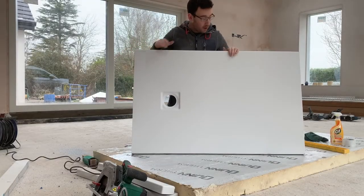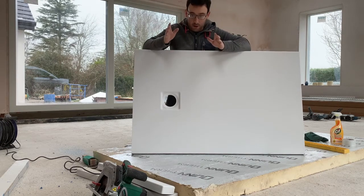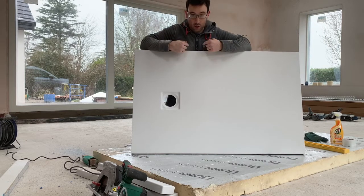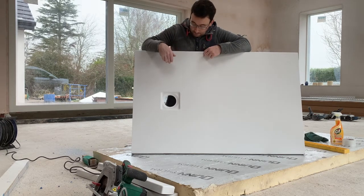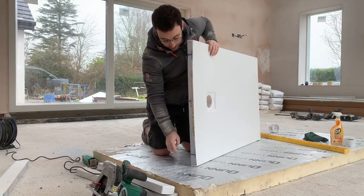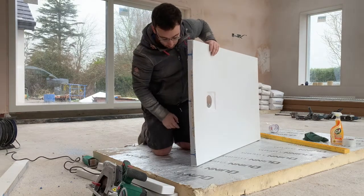That's fully cut on both sides. We've got 1250mm consistently from end to end, so it should fit perfectly. We took 75mm off each side. If you can get the right size, the less cutting the better — if a 1300 existed, I'd have just taken 50mm off one side. You'll want to put sealant on the cut edge, let it harden, sand it flat, and get a good sealed edge so there's no water ingress into the wood.